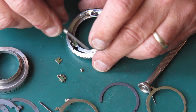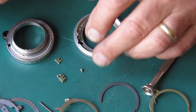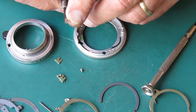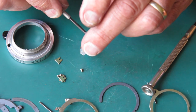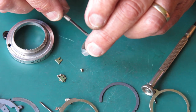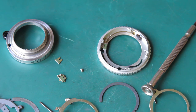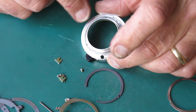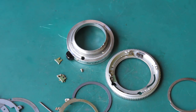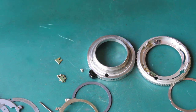You can probably leave one of these wedges in place while taking things apart — it's only if I need to make an adjustment that it would be an issue. The screwdriver is just too broad to drop into those slots, but I could certainly deal with that if needed. There's a bit of graphite grease on there by the looks of it, and it's a bit dusty — not a bad example at all. All of these components need to be cleaned with naphtha.